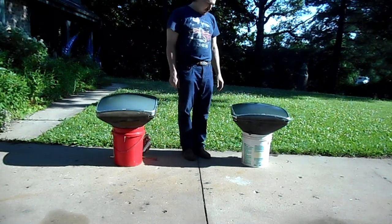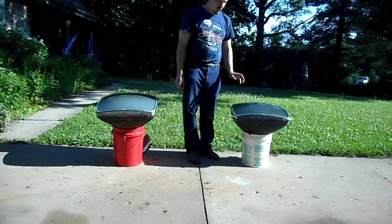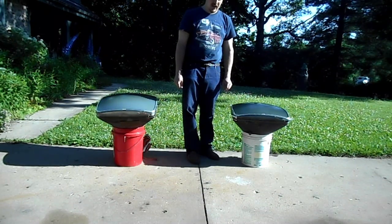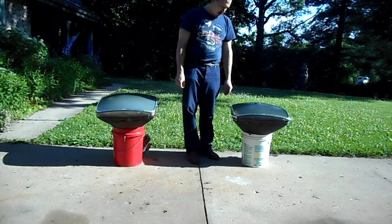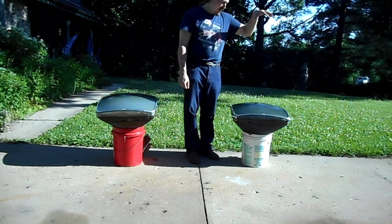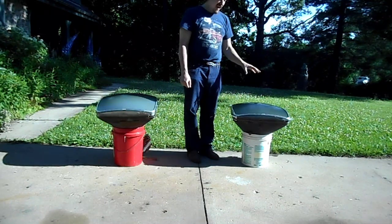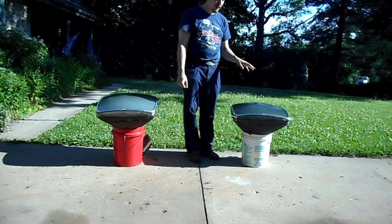The normal procedure would have been to put those clothespins in and let the sun work on it. Now, here in Wisconsin, the sun is not always as hot as it would be, say, in Florida or California or the Southwest, so oftentimes what I do is I hang a 250-watt incandescent heat lamp up above the tube, probably about here, and use that. After the tube sat in the sun for about an hour or so, I'll turn on the heat lamp and let the heat lamp boost the temperature slowly even further.